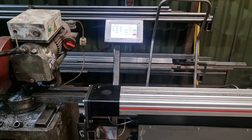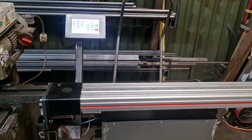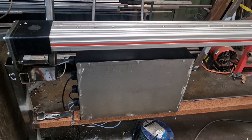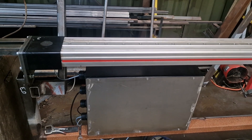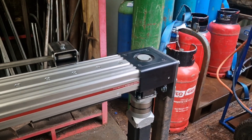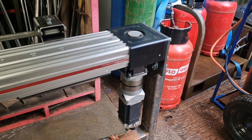Anyway, this is the stop — accurate to within about a quarter of a millimeter. It's not meant to be ultra accurate and it never will be, because I'm using an Arduino, a hobby MCU, not a proper PLC. You need real-time computers operating at much higher frequencies to belt out the pulses to spin things faster and get better accuracy. One benefit of the 50 to 1 gearbox is it does make it exceedingly accurate with no backlash. That gearbox was about 88 pounds — not a lot of money for the torque it produces.